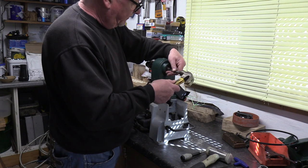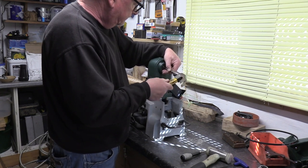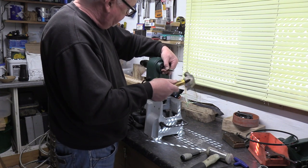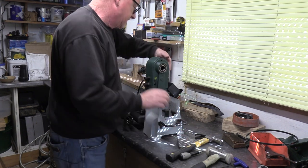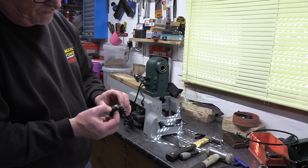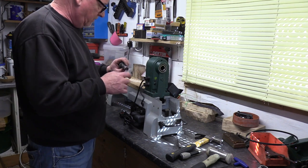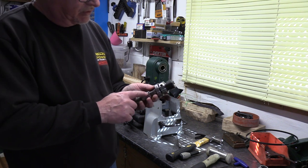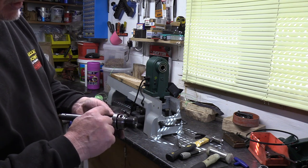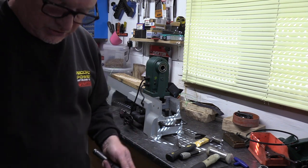Hopefully I've got this video as well. So I'm coming to the end of that now. That's your actual sprocket inside that catches the index in position, and you've got your fixing hole through there. What you'll find is on the shaft as well, the actual hole itself that you screw into is opposite your tommy bar holes — so those are in line, or thereabouts. So if you want to mark that off as well, you'll know where your actual fixing hole is for when we put it back into the body again.